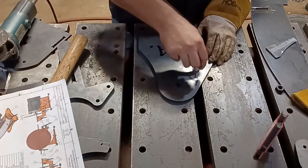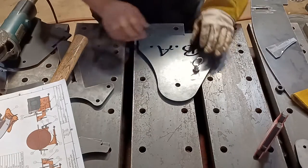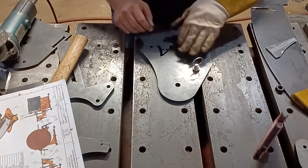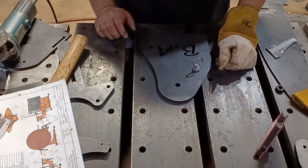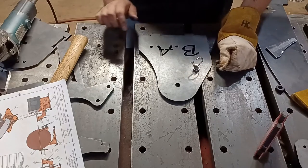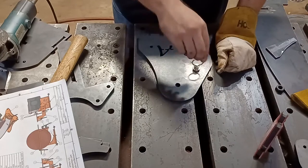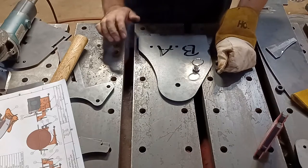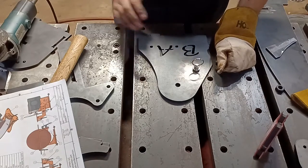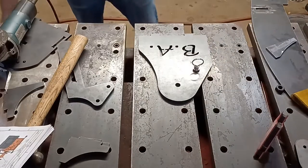This nut and part are stainless steel, so there's nothing to remove — no vinegar, no sanding, nothing. If you want a beautiful TIG weld, make sure you remove the oils from your hands. I'm just going to tack it in three spots to hold it on. When I actually use this for function, once I get the distance set, I'm going to put Loctite on it. You can get a second jam nut if you'd like — but Loctite is going to work just as well.